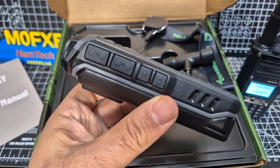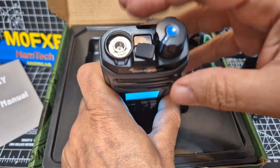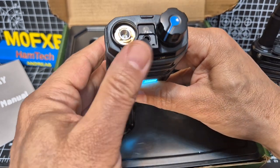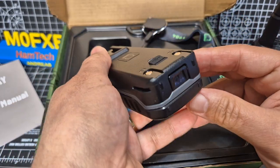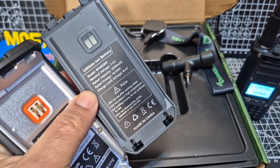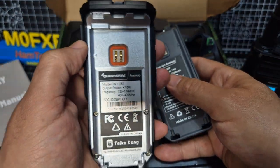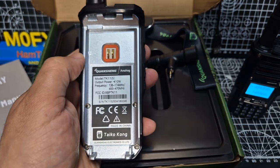You've got your normal Kenwood-style connectors for programming and the software works fine — no problems once you get used to any software. Two PTTs that actually work, and two programmable buttons. They've fitted nice big knobs, which has made the antenna area quite tight, but it's still usable. The battery shows 2500 mAh here, and these do 10 watts — tested by many, with harmonics on the intended bands completely fine.